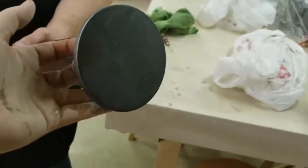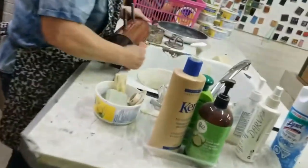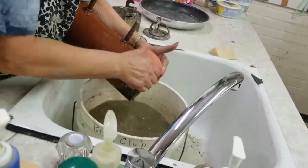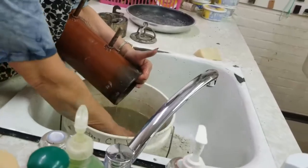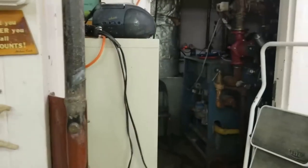Here we go — as you can see, it's all nice and clean now. There's no clay left on it whatsoever. Then we're just going to go ahead and put that away, leaving it all nice and clean for the next person to use. Use sponges, rags, whatever works — just make sure it's all clean. Then put it back on the wall. Do not tighten the wing nuts all the way, or they can seize and get too hard to pull off. Just enough to hold it on the wall while you use it. And that's all there is to using the extruder and cleaning it.